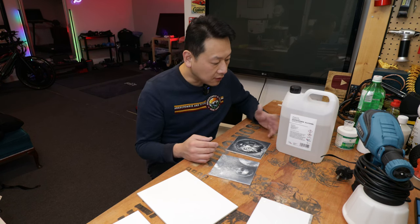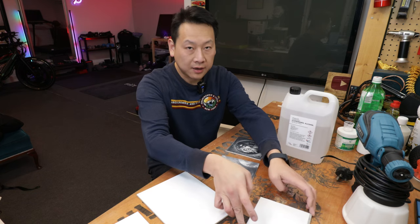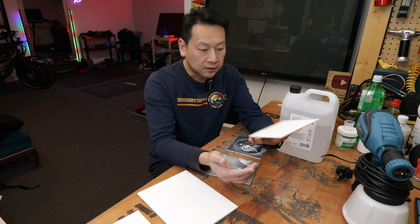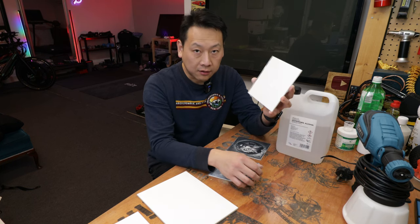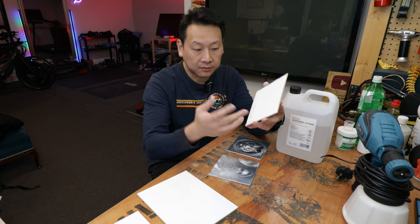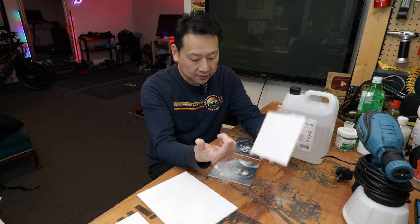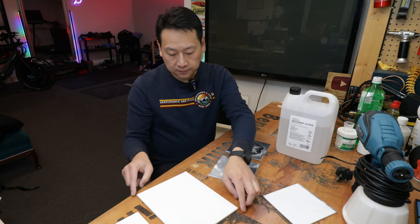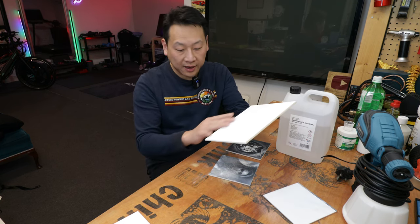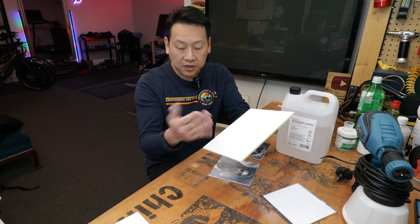There's no smell to it, there's no harsh chemical like solvent. The other big advantage is that the spray products I've used in my last few videos leave a fine layer of powder on the tiles, and as soon as you touch it the powder comes straight off — if you then laser that part it will be a defect. With the paint-on PVA glue method, I'd avoid touching it as much as I can. You can still scratch it with your nails, but if you just touch it hardly anything will come off.